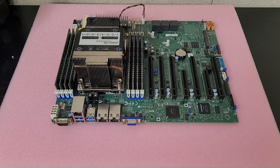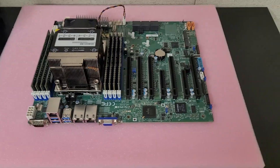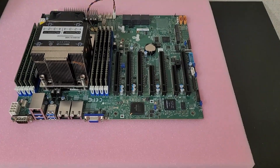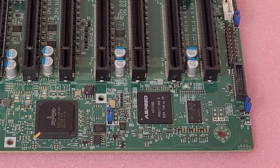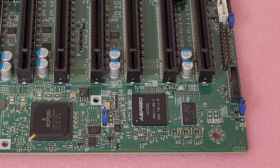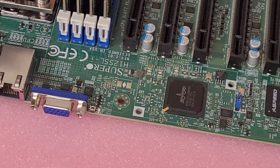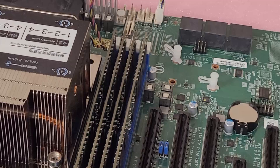What's happened is the BMC is dead. The motherboard is trying to wait for the BMC to power up and do its thing, and that's causing POST to go for longer than normal. Eventually it just gives up on BMC and posts without it. But without BMC functioning properly, you're not going to get things like your VGA output or your fan speed control.